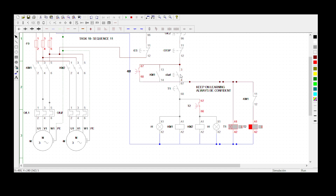Let me start the process again. Start button pressed — after the preset time both motors must start rotating, then after another preset time one motor stops, and the other continues to run until stopped by a stop button, emergency stop, or overload. Remember: Timer 1 never changes contacts until it finishes counting — it just starts counting immediately when energized. Both motors are now rotating, all lights are on, and the delay-off timer has started counting because KM1's contact has opened to allow Timer 2 to count.